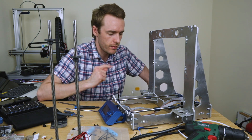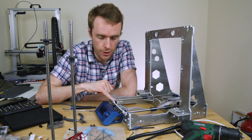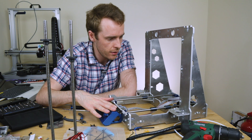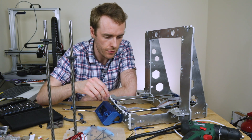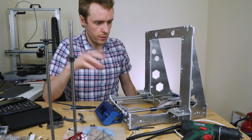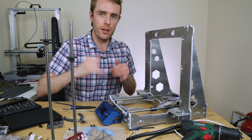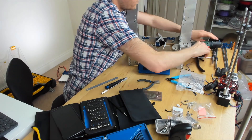Right, let's get a print started and work on some stuff in the meantime. To fit those parts I'm printing, I'm going to have to remove these four parts — might as well do that now, which also means I don't have to remove the LCD again. So two steps forward, one step back. We can put in the new lead screws and mount the whole X-axis, so Z and X axis, and then we'll do the Y and LCD after that.